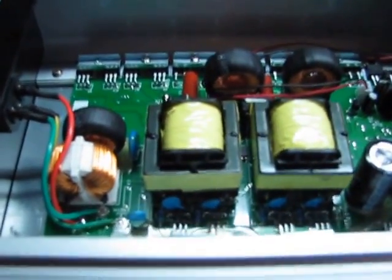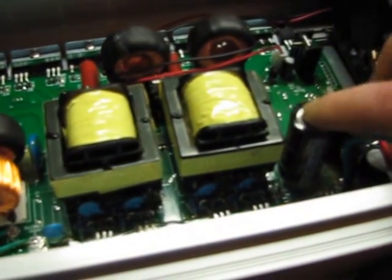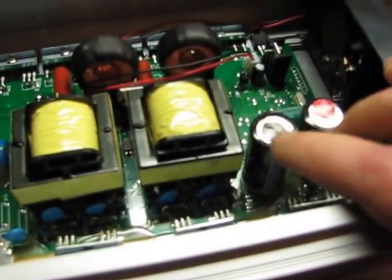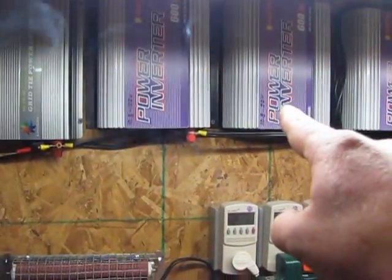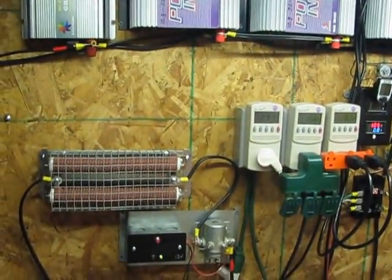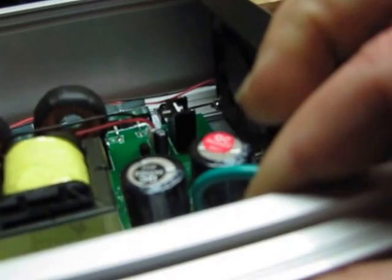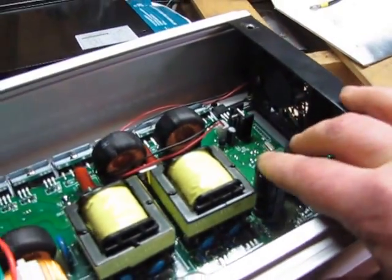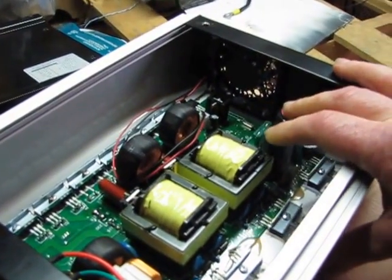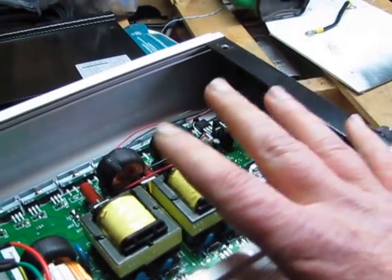Here's the inside of the Sun 600-watt, 22 to 60-volt grid tie. These capacitors in here — I had one on my 10.8-volt unit burn out because I over-volted it. But these ones go all the way up to 63 volts, so it can actually handle an input of 63 volts maximum. You don't ever want to get close to the maximum on these though.